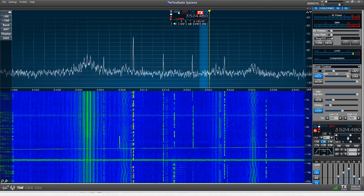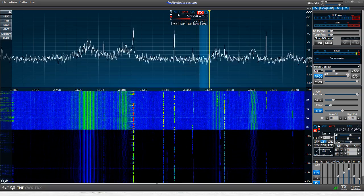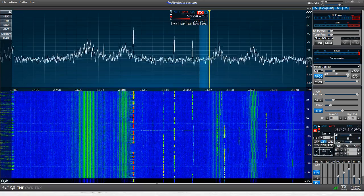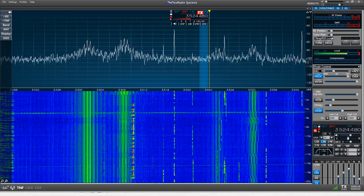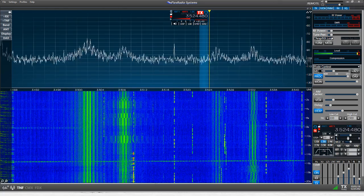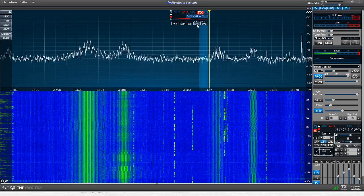I didn't want to blast your ears with the RFI down at 3500 at the bottom of 80 meters, but with the magnetic loop I'm more confident you're not going to go shrieking out of here. We'll give you a bit of audio so you can begin to hear the difference in noise floor improvement. Now, one thing you might notice is that not only is the noise floor lower, but the signals are lower — they are not as loud as on the full-wavelength delta loop. That's almost to be expected. But the appeal is that the noise floor drops so much that quite often the signal-to-noise ratio improves to the point where it's much more intelligible. So even though the signal might not be as strong on the magnetic loop, it certainly is more intelligible.